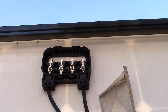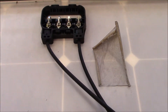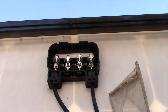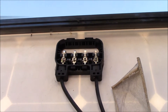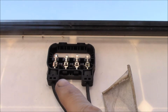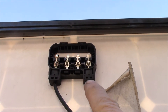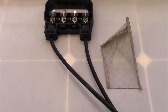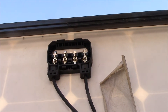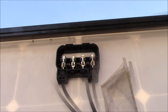I came up on the patio roof here. This is the back side of the 270 watt panel and I pulled the cover off the J-box. There's a definite smell of something burnt — that first bypass diode was running at least 100 degrees C and the rest were around 60. I'm only getting about 24 volts open circuit out of this panel, though I get 9.1 amps short circuit current.